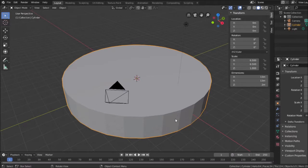Now this thickness assumes it's 2 millimeters thick, and it's not. And that's one thing I forgot to measure, is the thickness of the piece. I knew I'd forget a measurement. So I'm going to do that real quick off camera, just to get an idea of the thickness of the entire sweet plastic. And I get 1.8 millimeters. Make sure I'm not grabbing any plastic that doesn't belong in there. Okay, I get 1.8 millimeters.